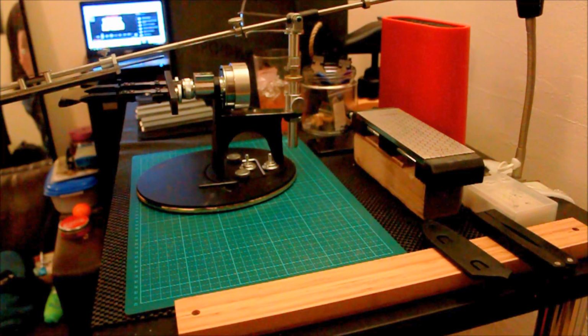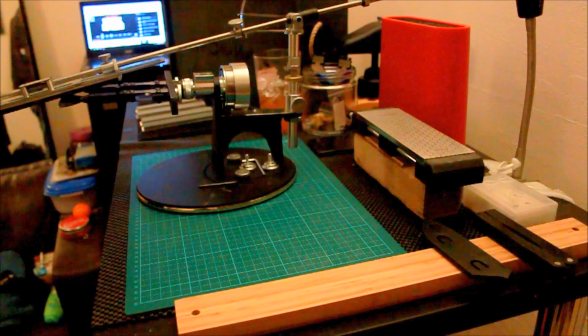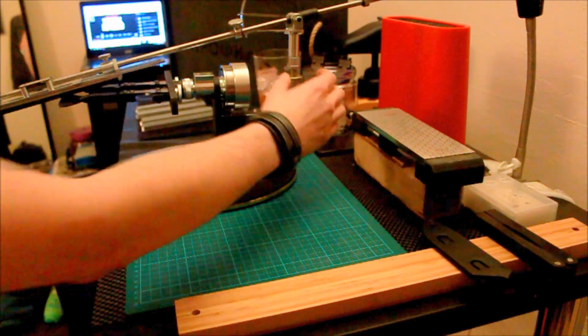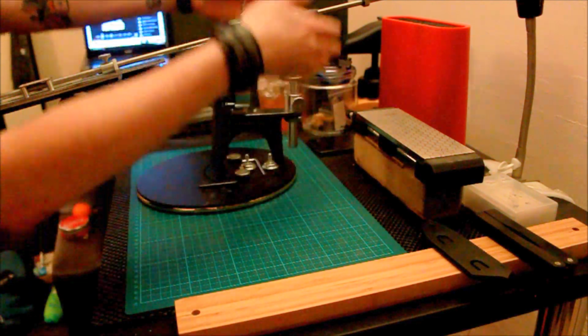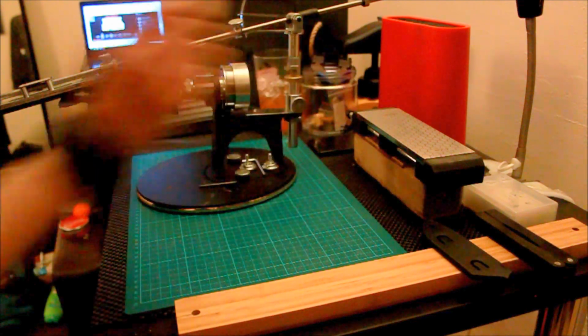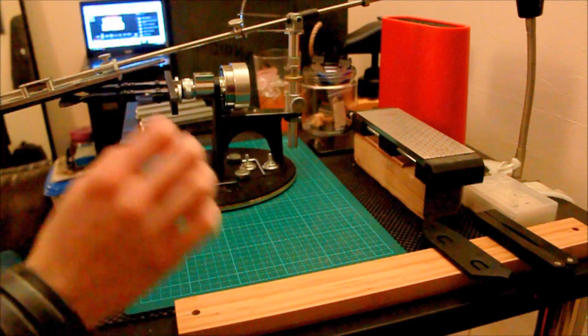And we'll place the stone on the blade, and now we can check the angle over here that it's about to be sharpened to. This is already set up for this knife, so I don't need to mess around, but there are brass screws over here for tightening and untightening. This one allows the whole bar to move up and down, which changes the angle. The one with the brass nut is for micro adjustments, just to get that perfect edge.